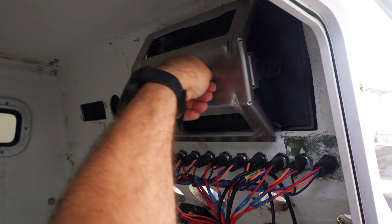So this will be the plate for here. We got the shiny part here and we got a dull edge here. We're gonna make this dull edge shiny. First thing you do, you take a piece of sandpaper and sand this edge with 400 grit sandpaper to 600 grit. And then you just take a torch and lightly torch it. And now you lose that dull edge.